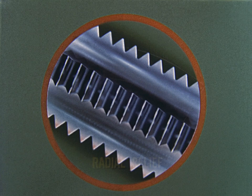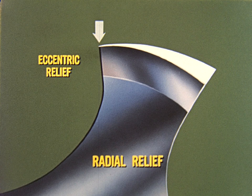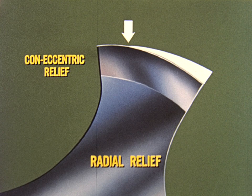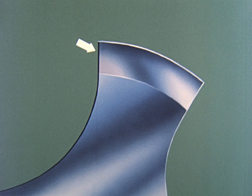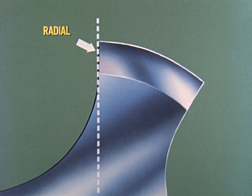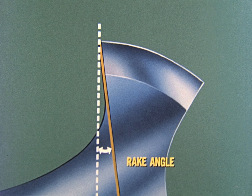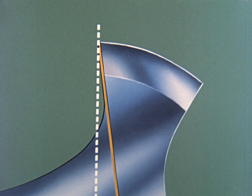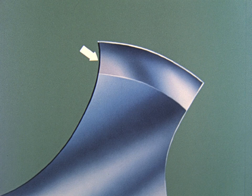The tap tooth may have relief called thread relief or radial relief. This keeps the tooth at the heel of the land from rubbing on the work. If the cutting face is flat and parallel to a line through the tap axis, the face is said to be radial. If the face is flat but not parallel to a line through the axis, the face has rake. The rake angle is the angle between the face and a line through the axis. Here the rake angle is positive, and here it is negative. If the face of the tooth is curved, it is said to have hook.